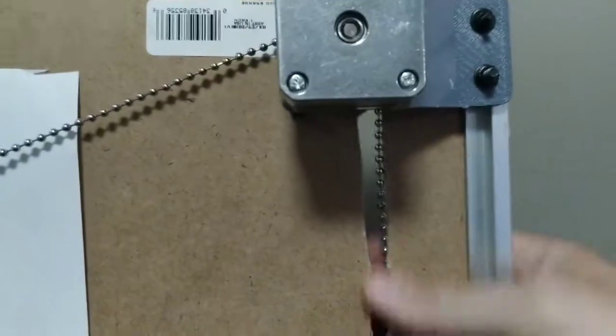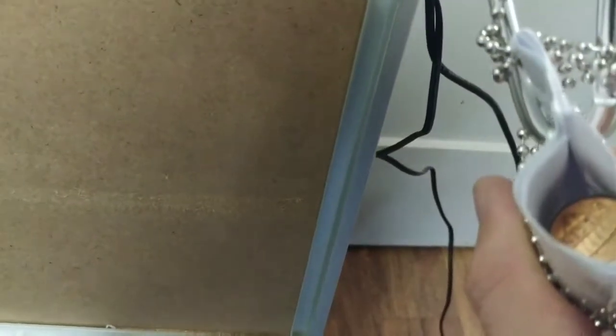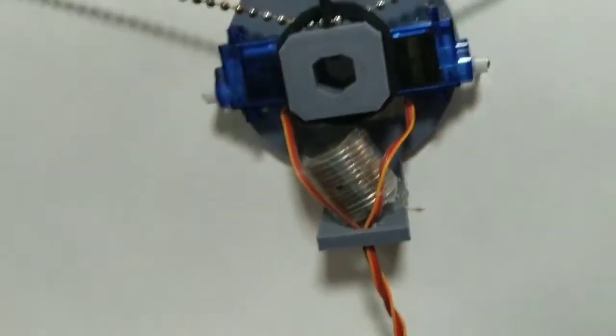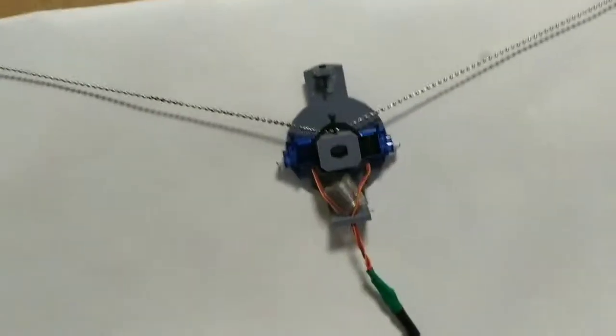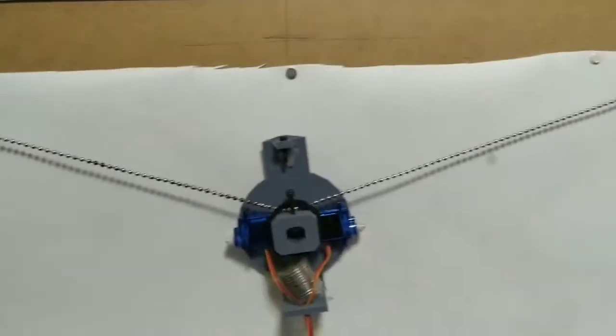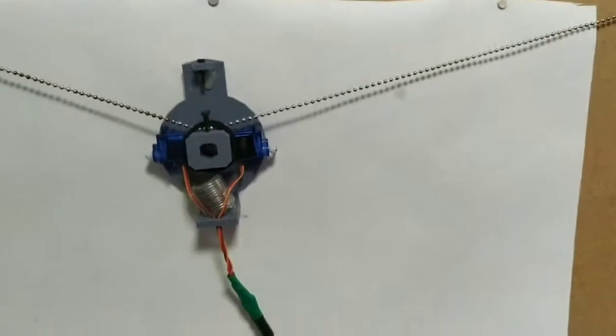Okay, things to know. One key design decision is to let these actually flow free back through the board, to just have a hole here so that the weights can dangle. How much weight is there in here? On each side there's about, I'd say, 40 pennies and about 10 nickels. And then over here we've got something like 12 quarters. Getting the weight balanced so that when there's no tension, this sits right about here, is pretty critical to getting good prints to happen.